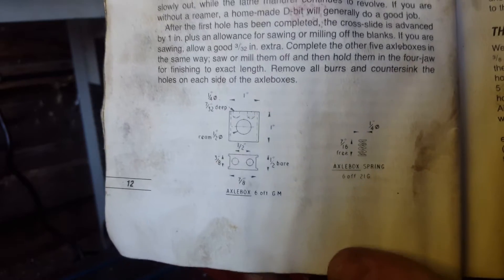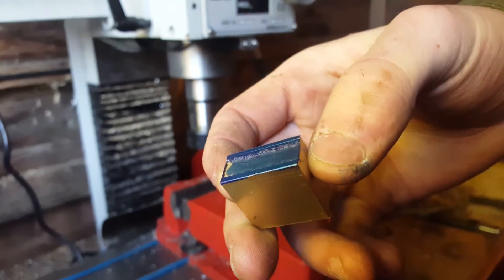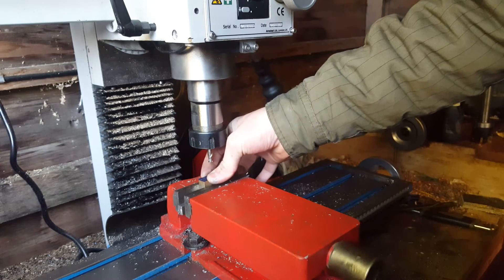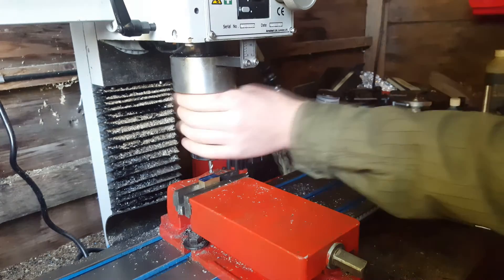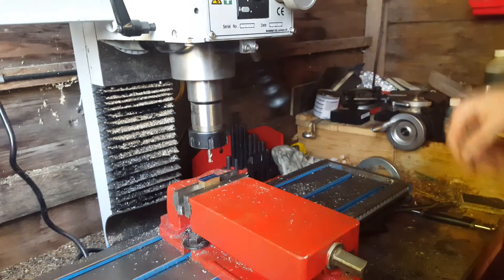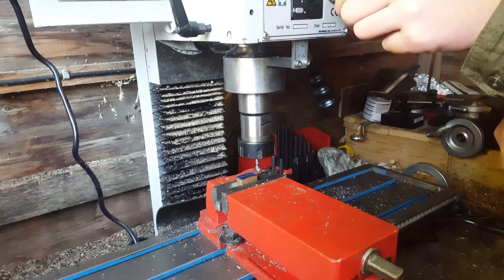Now this is a bit of a tangent — I'm going to move on to a replacement axle box for the rear. It's a blank I milled earlier, two inch square, probably half inch thick. There's a 3/8 inch slot through it, moving 1/16th either side. I'm just setting the depth to zero on the top and then I'll move it down to about a sixteenth below the surface — 0.0625.